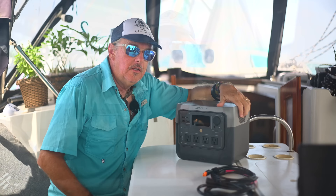This isn't just a power station - it's also a solar generator, so you can hook up solar panels directly to this. Those are optional accessories, so if you want to use it for solar charging you need to buy the adapter cable that plugs into the back, which looks like an XT60 connector with MC4 solar connectors. Once you get this adapter, you can plug it into any solar panel you want up to a maximum of 220 watts. It has a range between 12 volts and 50 volts for the solar panel, and they do make a perfectly matched solar panel to work with this unit which you can buy as a package.